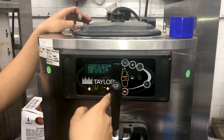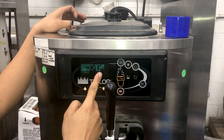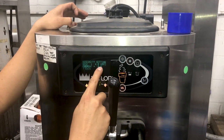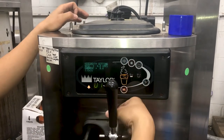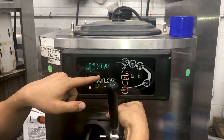Voila, right here. You're gonna hit select. From here you're gonna see your viscosity settings. The VISC 4.0 amps — this number right here is your currently set setting. Your current setting is what the machine is running at. If I pull the handle, it'll cycle and show you what it's running at currently.